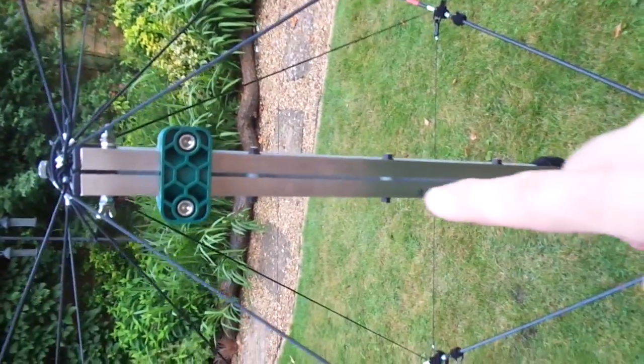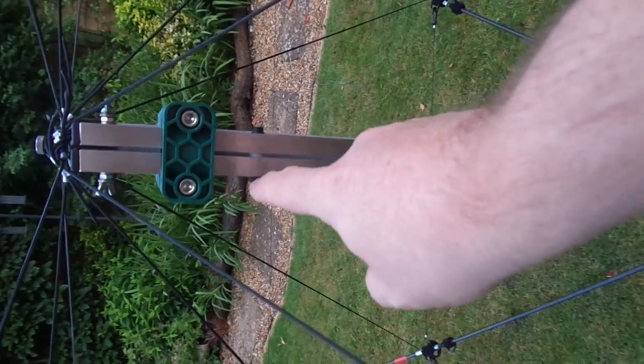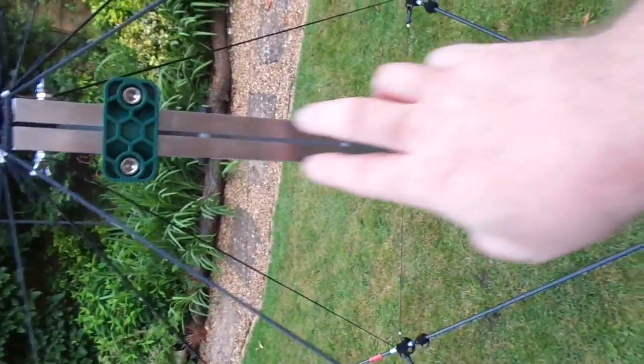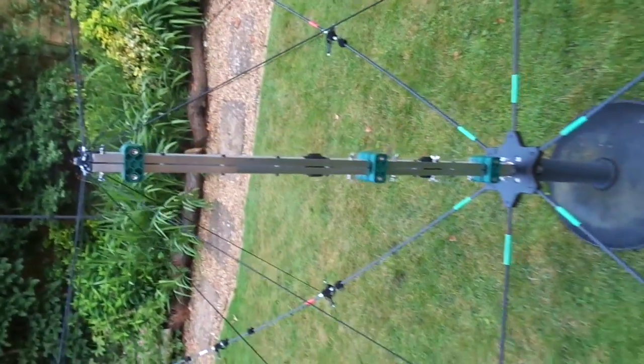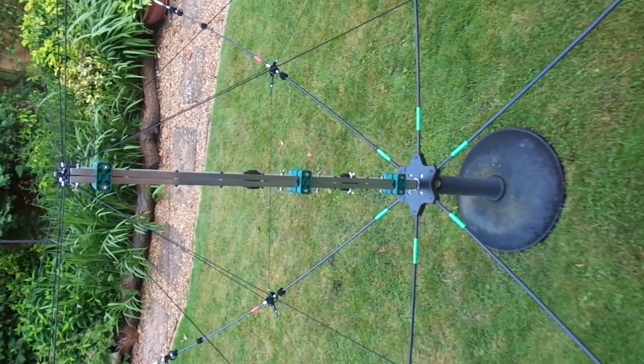It's been kept to the exact distance it needs by these little tiny PTFE washers and a nylon bolt going all the way through. It's held very securely in place, so this is a transmission line. I'd be a bit dubious as to whether or not that's actually got enough spacing in it for high power when it's wet or icy. Anyway, that's the transmission line.